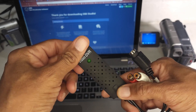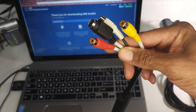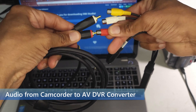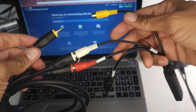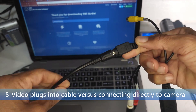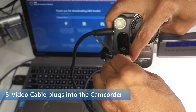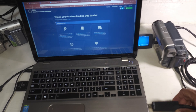This video DVR has a USB on one side and it has the female audio and video connections on this side. I love the fact that they're female because you can plug your dubbing cable directly into it without using the couplers. So I'm going to take the audio connections from my dubbing cable and plug them in, red to red, white to white. I'm going to use the S-Video so I won't use the yellow. Since this is a female connector, I'll have to plug in an S-Video cable which was supplied with the kit. My dubbing cable will go into the AV port here with the 3.5mm jack. The other end of the S-Video cable plugs into the front of the camera. So now everything is connected to the camera. All I have to do is plug the video DVR into the computer.